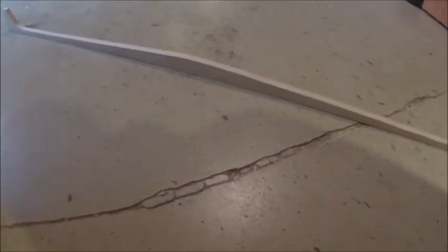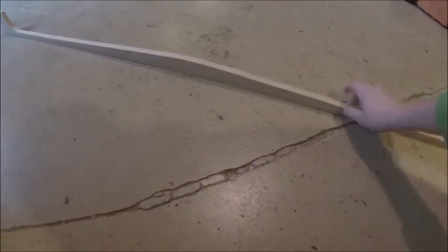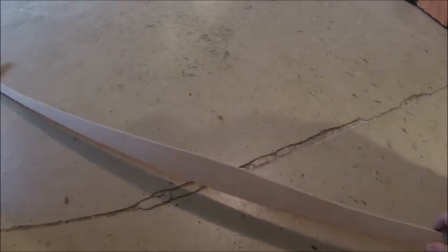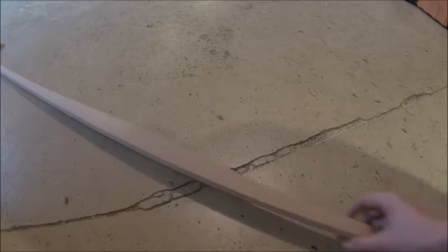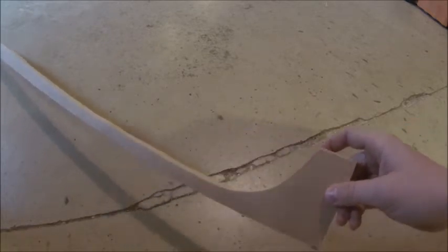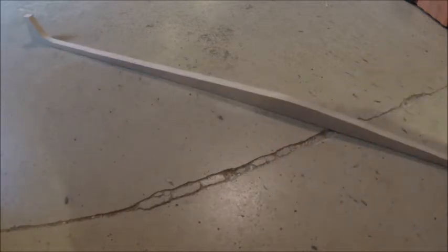So if you want your skis half an inch off the ground because you're making a cambered set of skis like I am, then you want your middle point that is raised off the ground to be about a centimeter and a half inch off the ground. Your skis will sag a centimeter when they're taken out of the press.